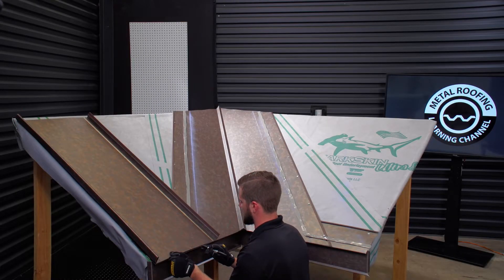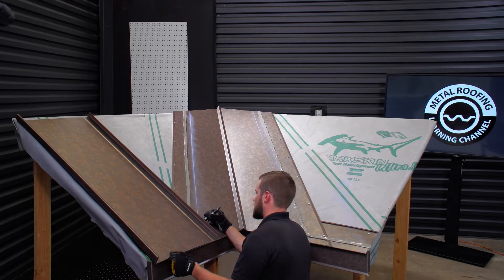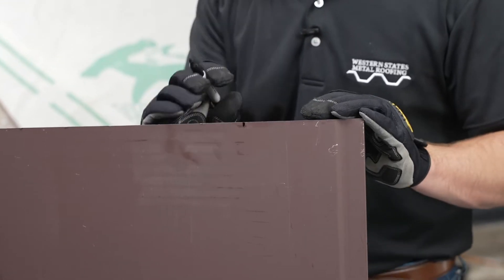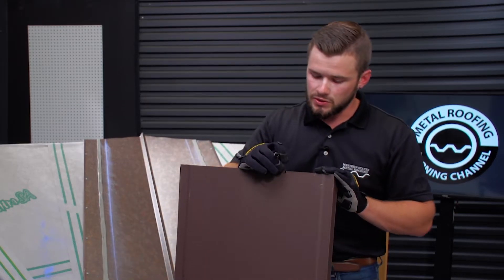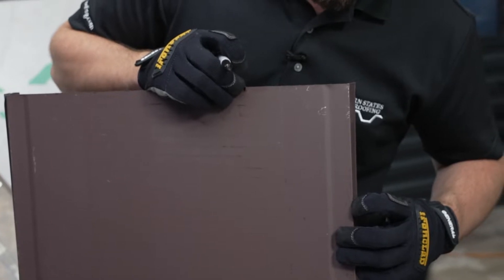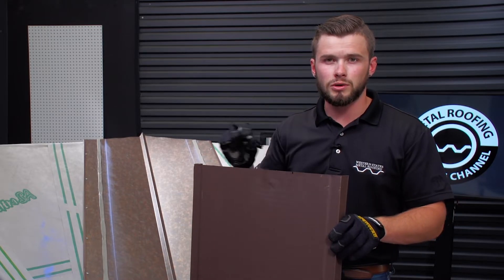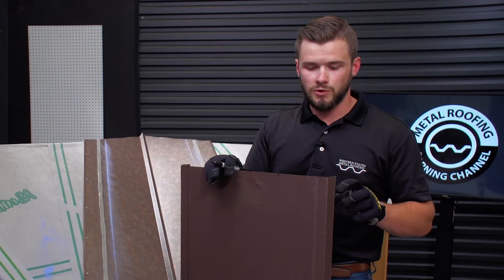I marked the front with a little mark on my eave and also have my chalk line back here — I marked both on the chalk line and on the high of the panel. This line in the pan of the panel is where our chalk line is meeting the edge of the eave. I'm going to draw a square line up the high of the panel, connect our two angle lines to cut this little triangle out, and mark our fixed screws on the eave and two inches up from the cut edge up the valley.